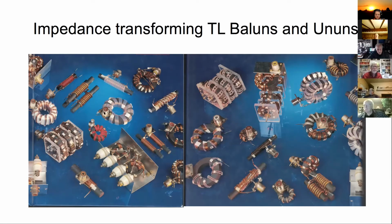So in a case like this, I'm trying to see if there's over here. Here's a bifilar winding of wire that's kind of encased in some Teflon tubing, and it's a transmission line because these wires are right next to each other, and they're going to be something akin to open wire line, okay, or twin lead, which is nothing more than 2 wires that are separated by some sort of dielectric, and they're evenly spaced apart. And that's a transmission line. Old twin lead that you use for your TV going to the rabbit ears is that, okay? It's not going to be 50 ohms. It'll be different than 50 ohms.